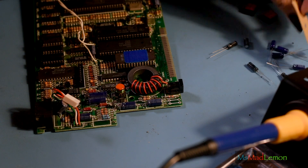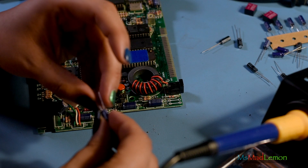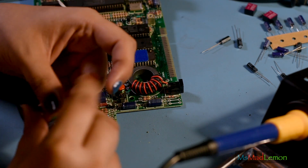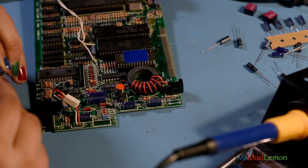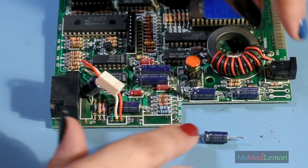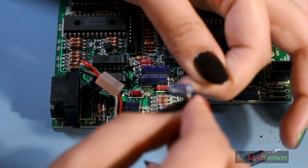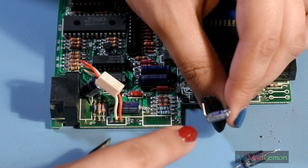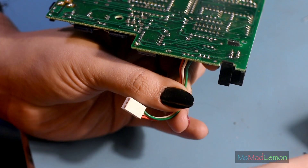Let's search for that — we take our time, there's no rush. We're only going to do this once — well, I'm going to do this twice. It's 4.755 — fantastic, picked up the perfect one, 4.7 yeah, it's positive here. It's a bit annoying that axial capacitors are preferred here but the kit comes with radial capacitors, so I'll bend the negative leg over on the radial just to make a makeshift axial. Actually, let's solder this switching regulator in now.